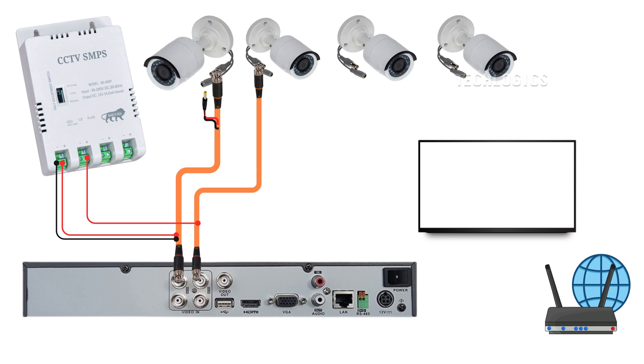Please use these 3 wires solely for the camera's power supply. At the DVR side of the 3+1 cable, prepare the 3 wires for connection to the SMPS. You can use any color combination for the wire codes, but it's crucial that both ends of the cable match the positive and negative polarity correctly. Connect the power wire as shown in the provided illustrated diagram to ensure proper installation.